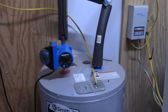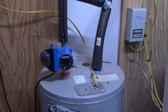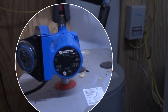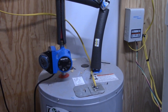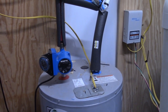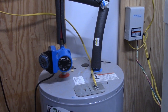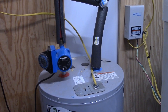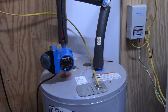This small 20-gallon hot water tank supplies the hot water for the entire property. Through that circulator pump on top, water is circulated through those pipes and then brought back to this water heater to get warmed back up. However, when we have the boiler lit, the hot water is heated solely by the boiler through a heat exchanger mounted in the big house.